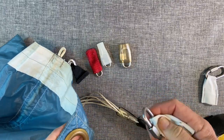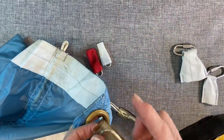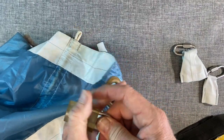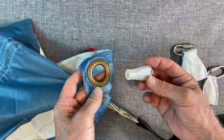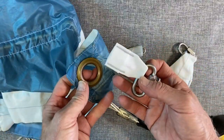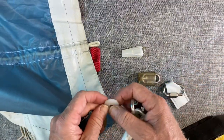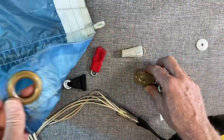Before soft links became the norm, metal links like this — the rapid link — were used by everybody. You'd certainly want to have the metal-to-metal contact with the slider grommet protected. Using a rubber tube, plastic tube, or PVC tube was kind of standard. Silicon tubes on the smaller links got popular, or a Type 3 fabric tape. At one point there was a plastic ring used to avoid the metal-to-metal contact, but it didn't actually help as much as the plastic tubes did.